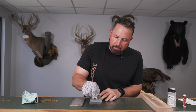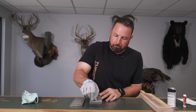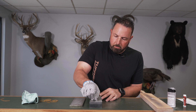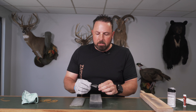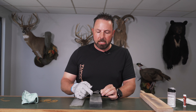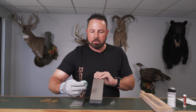We're going to do the same thing on the 1,000 grit — one stroke, turn, repeat — going seven times total. On the blade you're also going to start to see shiny spots forming where it was dull before. They're all starting to get a uniform, nice, really nice shine off the blade on each edge. As we get into the 1,200 it's going to get even better. There's material to take out of that diamond stone. Now we're going to flip this over and move to our 1,200.